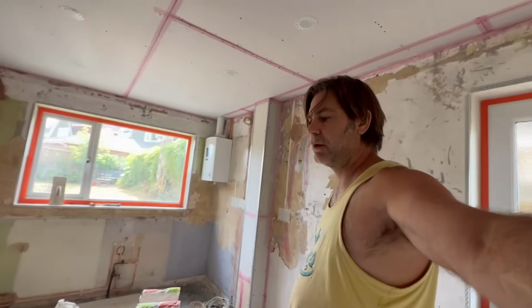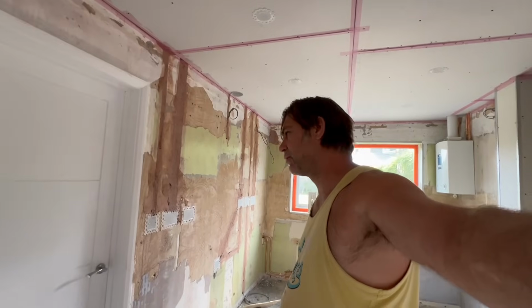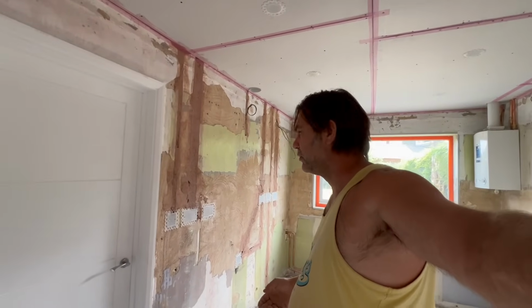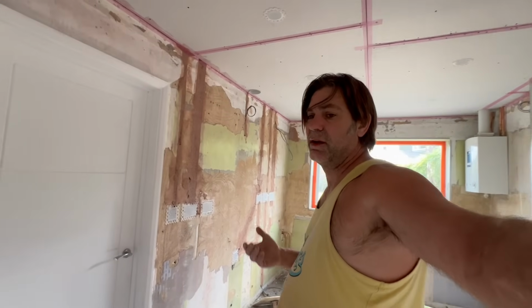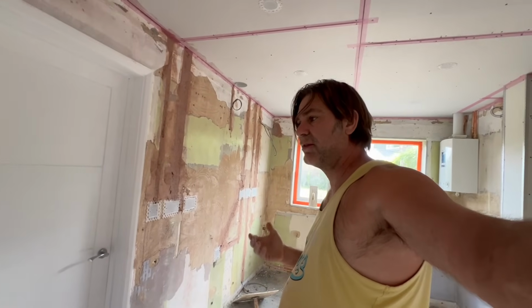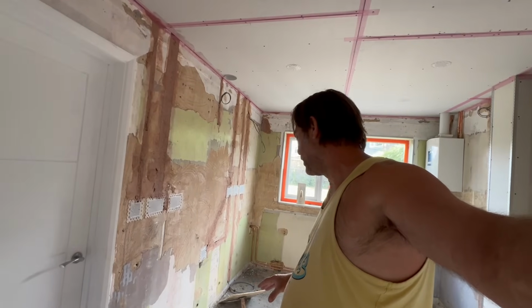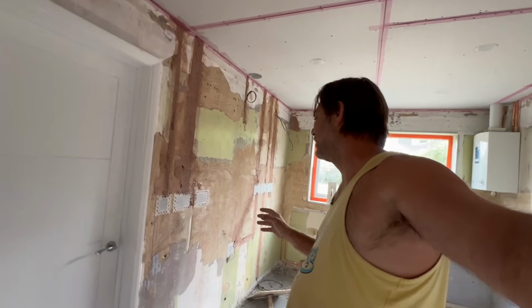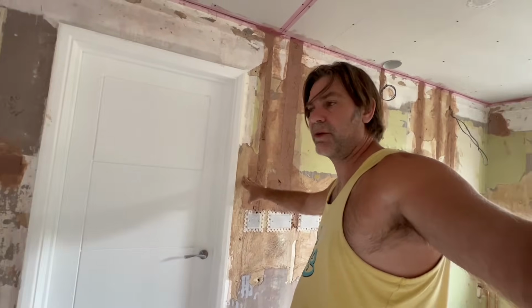Okay, shall we go over the whole SBR PVA grit thing as if it's the first time we've ever spoken about it, just in case you are new to plastering. We are using PVA. PVA is fine indoors. It's not as harsh as SBR. SBR is a lot wetter in its neat state and you need to be careful where you get it, like if you get it on the carpet, etc. But SBR is much more efficient at killing suction, okay? So this is where we've got really high suction. This is why we're putting PVA on there to kill it.